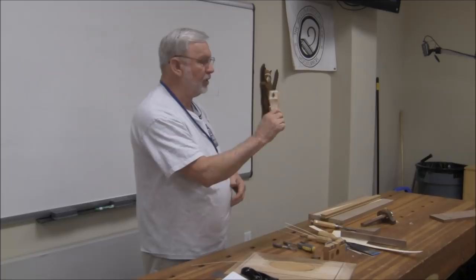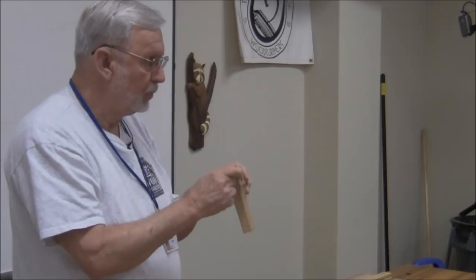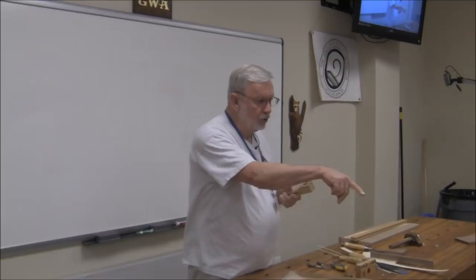You can put this in the top of a box, run some stringing, and put in the diamond — you can do all kinds of stuff with it. How do you remove the piece after scoring? With a thin putty knife — if it's real close, you can take your X-Acto knife and peel under it without ruining the piece. Don't glue it all over the surface — you'll never get it off. Just put one tiny dab, most of the time just one small one in the center. I've skinnied my putty knife down on my sharpening system and honed it, so it's pretty thin at the front and slides under nicely.